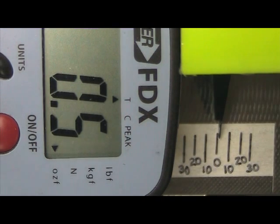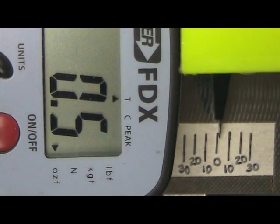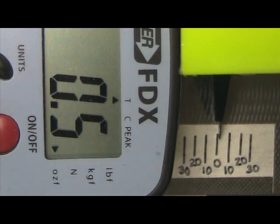This is the Vibe 50 tail but we are testing for Vibe 90 blades because the tail grips and links are identical on both of them. We have 102mm KB Dream Design blades, the same as the previous test, except this time we are using Chinese weights. Pay attention to the tension and compression on the gauge as we go out and come back — on the compression side it will maintain compression as we back up, and the same on the tension side as we back towards zero.